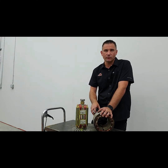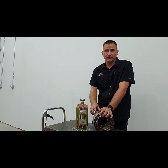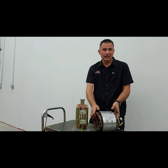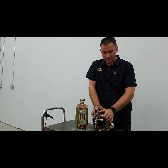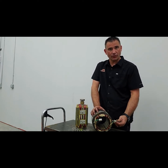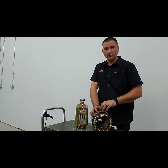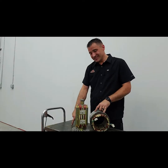Simply how the system works: the rotor spins, the voltage regulator puts a certain amount of current into it, this turns the rotor into a big electromagnet, and that excites the coil on the stator to make power. It's basically the same thing you did in elementary school science class - battery, coil of wire, and a magnet to light a bulb - just on a much bigger scale. There are also other wires in here that control the AVR; the AVR reads output voltage and gets its input from the stator itself.